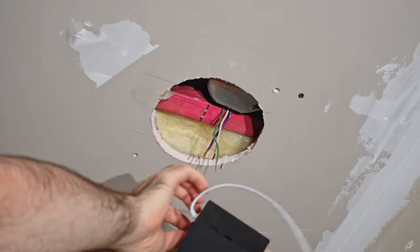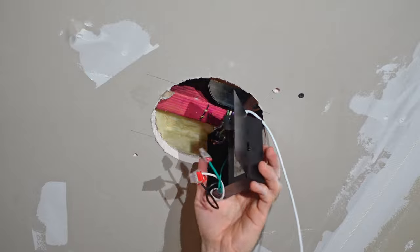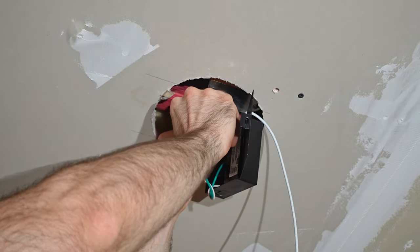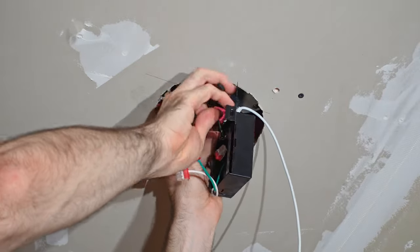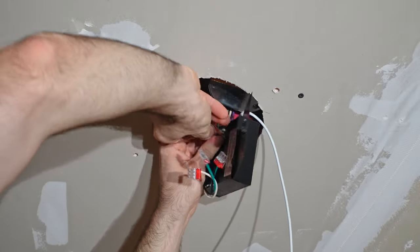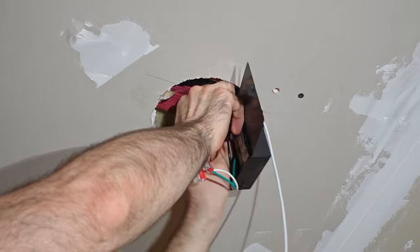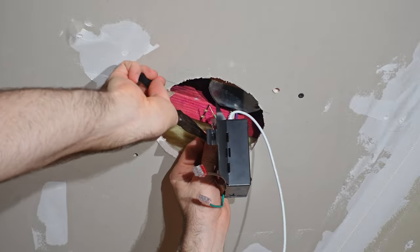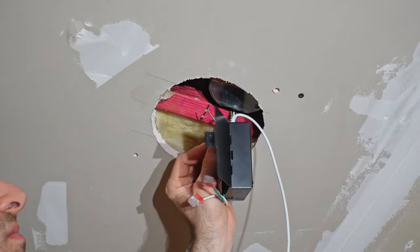Now that I'm ready to install the new electrical box that comes with the light, I've put a knockout bushing on the knockout I chose to remove — you have two on the box, one on the left and one on the right. I feed my wires into it and hook them up. You won't be able to see a lot here because it's hard to get the camera up into where I'm working, and the wires in this area are pretty short. The biggest issue is that they're not solid copper wire — they're braided strands, which made it difficult to push into the quick connectors.